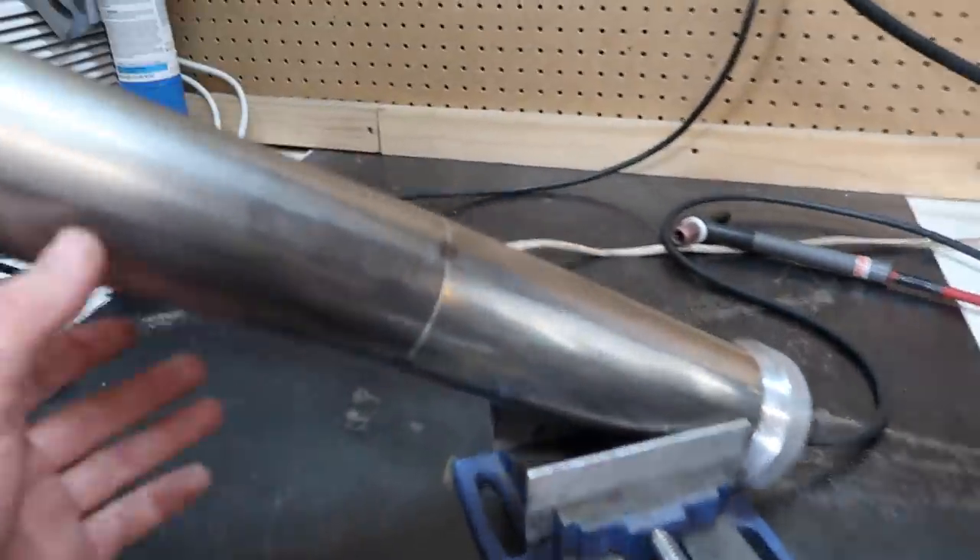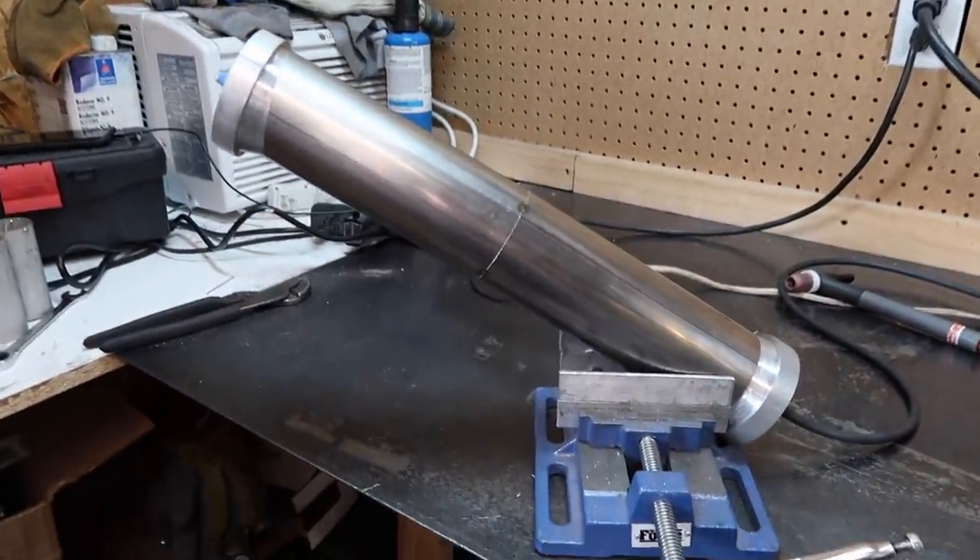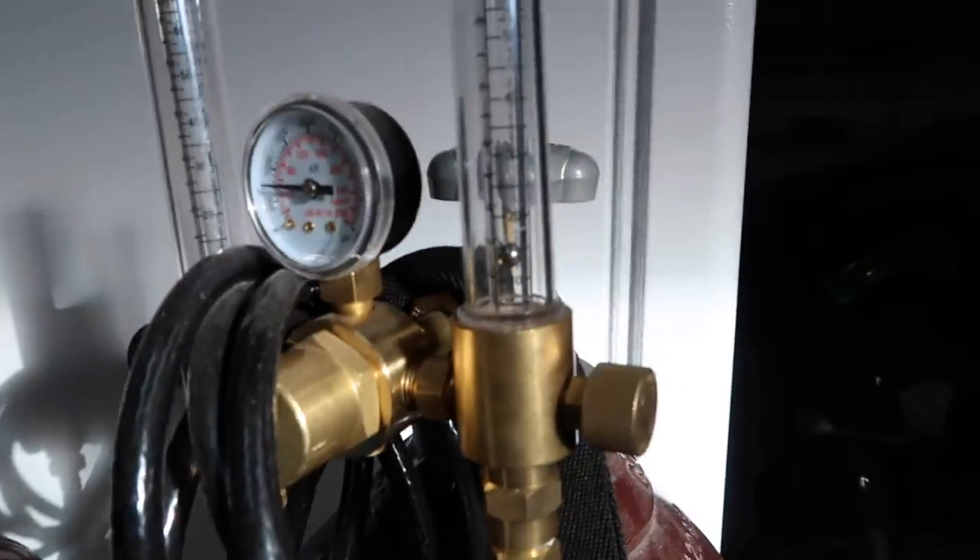Got the RX-7 for the most part buttoned up, I just need those parts like I said. I'm going to do some practice real quick, hopefully I get this job so I can fund some more race car parts - especially because this winter I need to do the four-link on the RX-7 and get a rear end for it. I got this piece of 3-inch tubing all set up for basically a 6G position. I got the purge going at about 15 CFH - I'll turn it down once I go to weld on it.